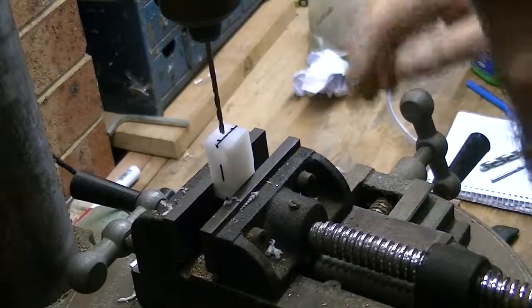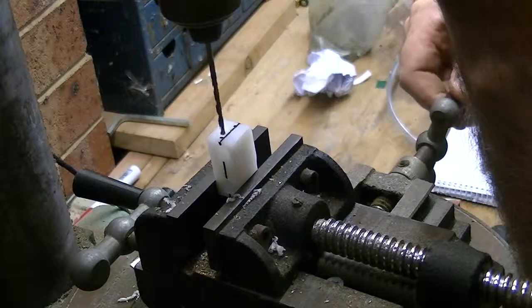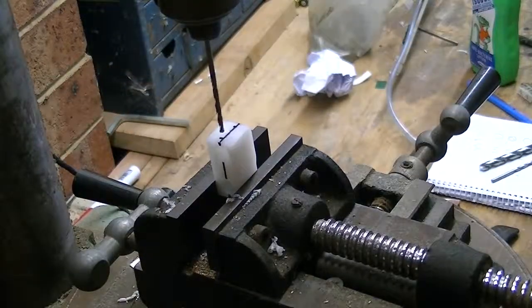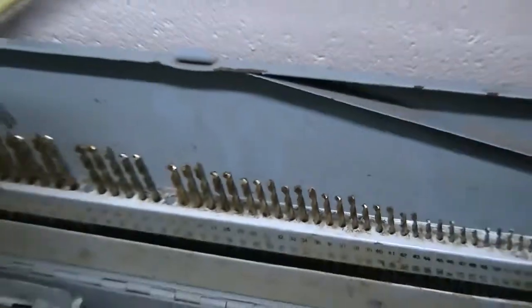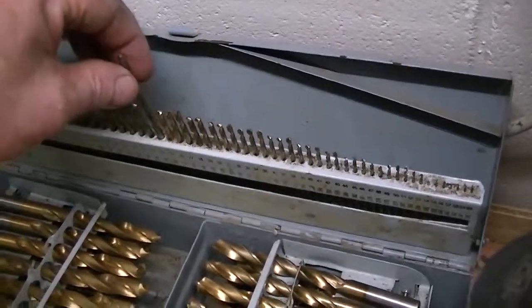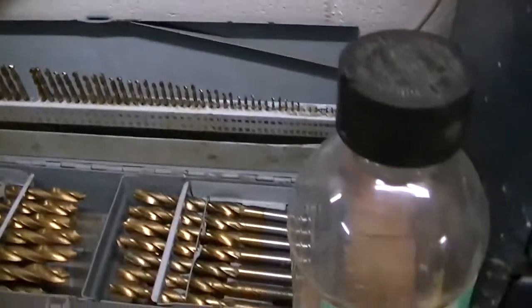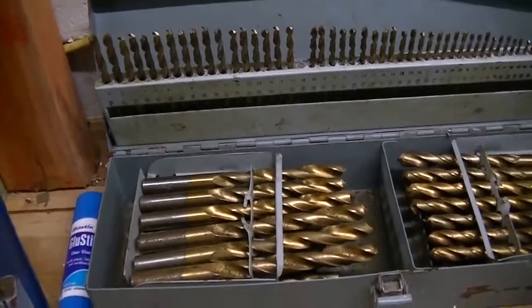A cross slide with a drill pedestal is just brilliant. You can make things so accurate using this, and it's just a great addition — and they're not expensive. You need a lot of drills. These drills are fairly inexpensive, but there's such a variety. When you have a good set of drills for pilots and so on, you can finish a hole to almost any dimension when you've got a nice pile of them.